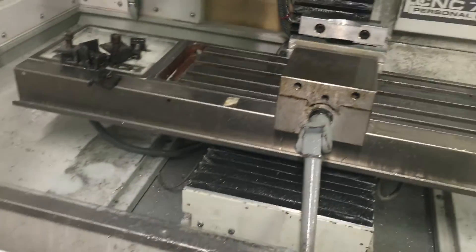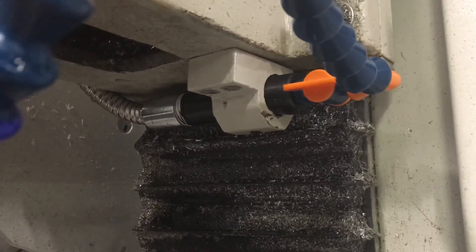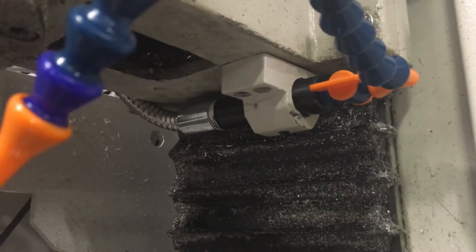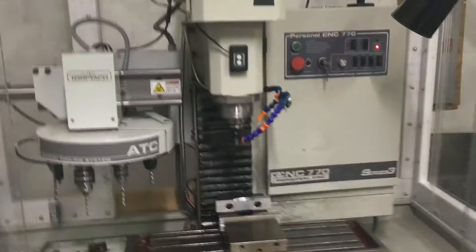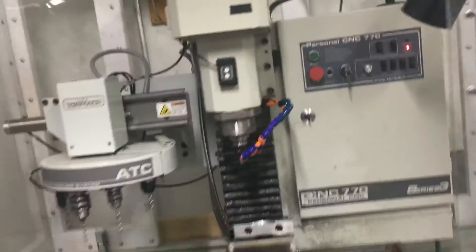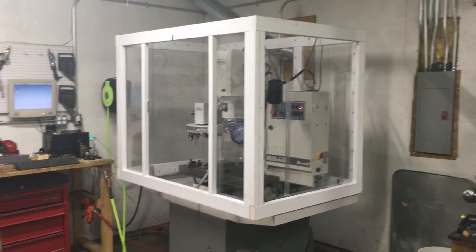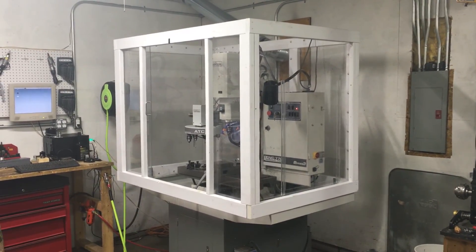The enclosure appears to be working quite well. I did have a little issue where I never got the customized mounting system for relocating the coolant system when you have the tool changer, so I just mounted it to one of the spare screws, put a little Loctite on it, and it seems to be holding nice and tight. I'm now looking forward to using flood coolant — I had been using the Fog Buster for several years, and it was just time to upgrade because I'm doing deeper slotting-type cuts. Thanks for watching!